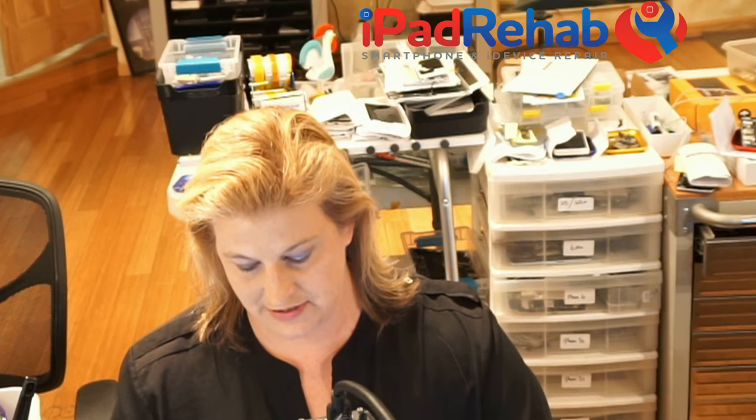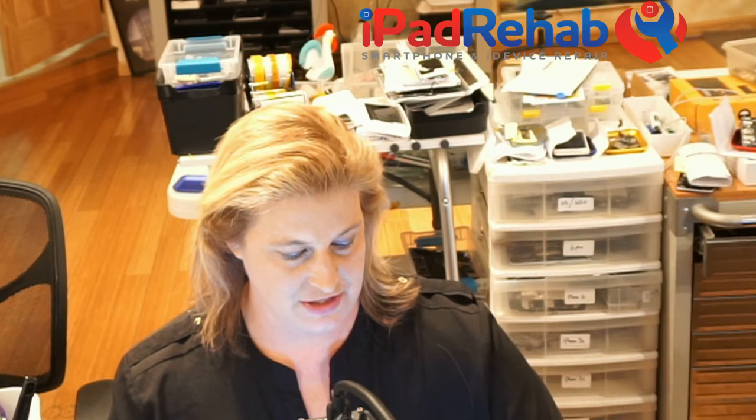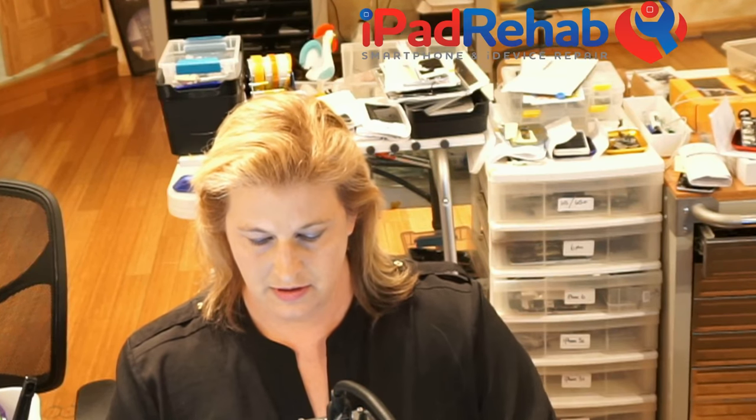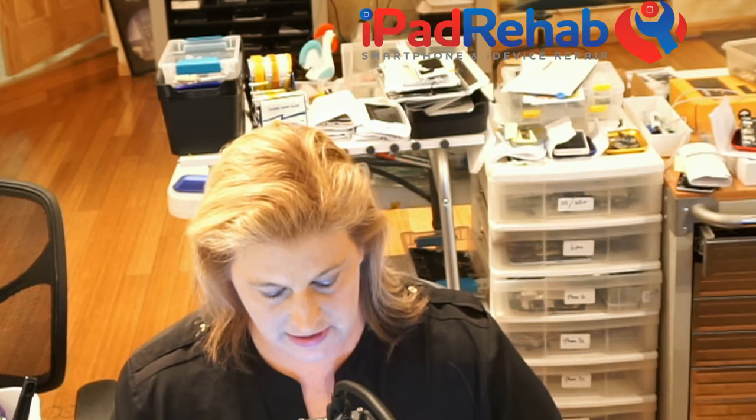Same thing for Chestnut, which is in the U3 position in the iPhone 5S and 5C. But in the iPhone 5, the U3 position is the commonly knocked off during battery pry damage chip that controls the home and power button power lines. So I think that we'd all understand each other a lot better if we just dropped the U2 nomenclature.